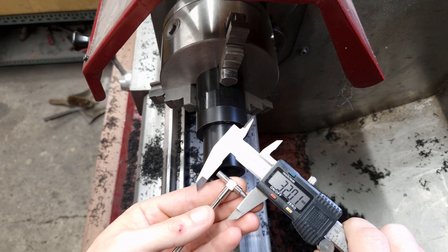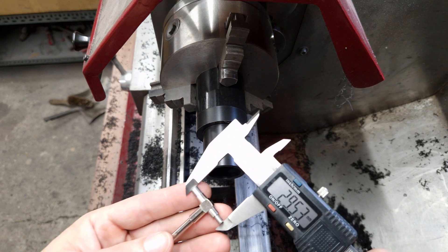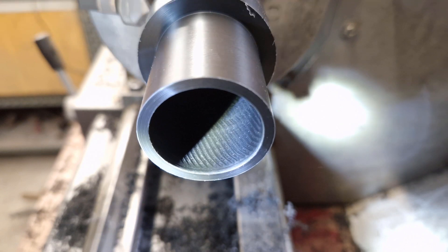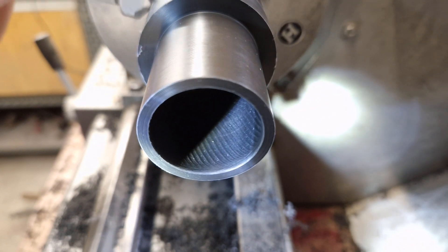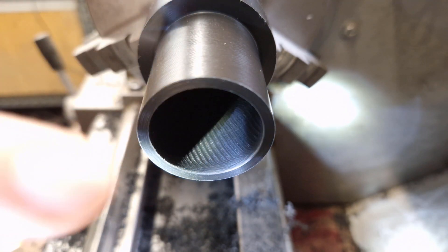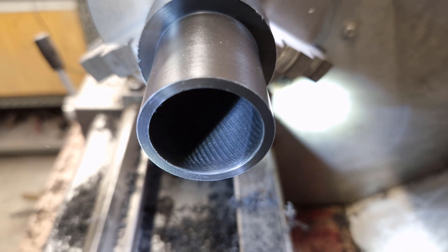This is my final dimension, and this is the point where I noticed that something went wrong. Let's take a closer look — I got chatter marks all over the surface. This isn't acceptable and I won't deliver something like this to a customer. Those marks are not from the boring bar or the lathe; they are produced by the thin walls of the material itself. If this was a metal part, I wouldn't run into this problem. But I will learn from it.